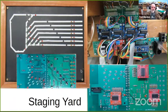First thing, let's talk a little bit about what's on this board. There are 39 LEDs and 9 push buttons. And I did not cherish the idea of wiring up 48 devices again. So I designed these circuit boards, worked out this arrangement with these push buttons and the LEDs that'll poke through holes in 1/8-inch masonite, and I made this panel.